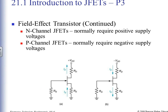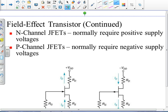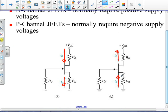Now we have N channel, which normally requires a positive supply voltage. The current is obviously going the wrong way in my picture. We'll move it over and have the current flow the right way. So my current is going that way, and my current's going this way. As my voltage on the gate increases, my channel gets smaller. As my channel gets smaller, there's less current flowing.